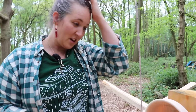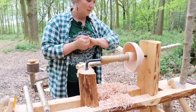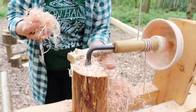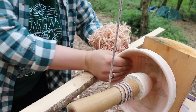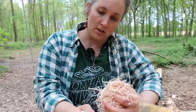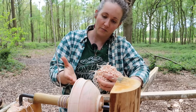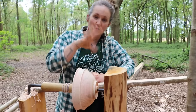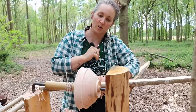Before I do that, before you're at the very, very end, there's a trick that some folks use, though it depends on the wood: you can burnish your bowl a little bit. These are actually quite dry, even though they were just turned, by taking some dry shavings. Now, I'm saying to do this because everything that we make is not sanded. Everything is just a tool finish. Almost all the things that we do in wood are just a tool finish. And when you have sharp tools and good technique, you really don't need to sand something. And when you do sand something, you really need to work up to very high grit, because sandpaper is essentially ripping the wood fibers. So you have to make those little tears smaller and smaller to actually polish them.